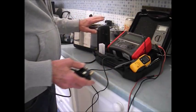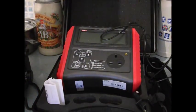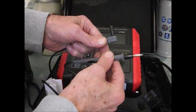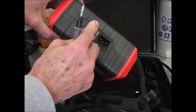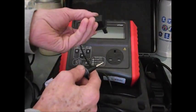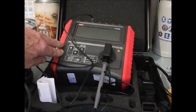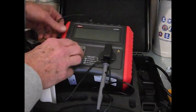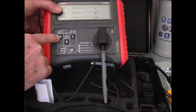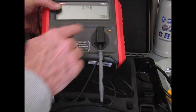So, now the next thing we do is PAT test the actual appliance itself. To start the PAT testing, what we're going to do first of all is zero the bond test lead. This is your bond test lead. What we do is plug this into the mark on the back of the PAT machine, then plug this onto this little feature here. We plug this into the front of the machine there. Then turn it on and hold down the earthing symbol button for five seconds, and it will null out the test lead. And it will say 'good.'